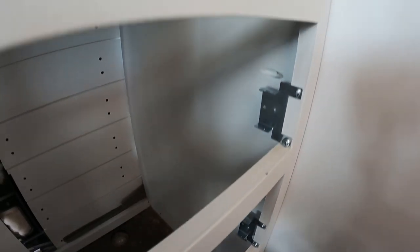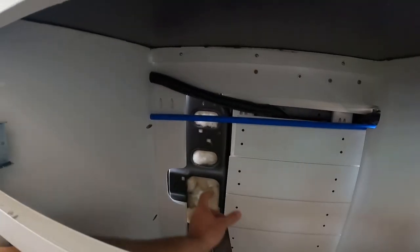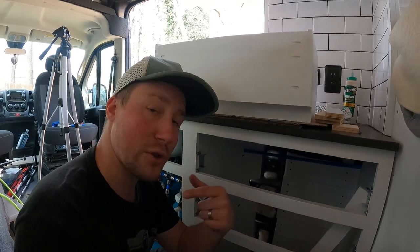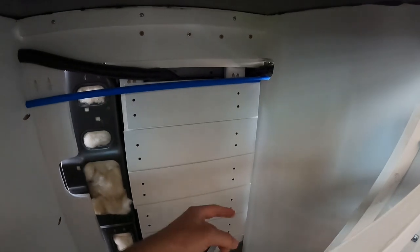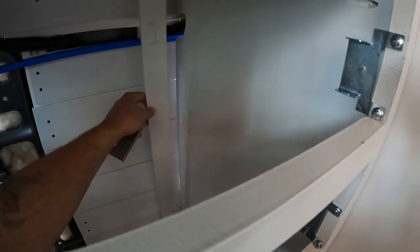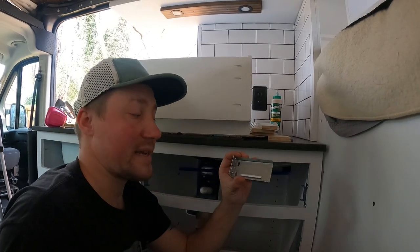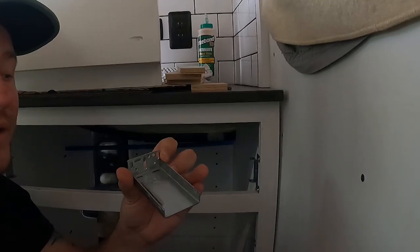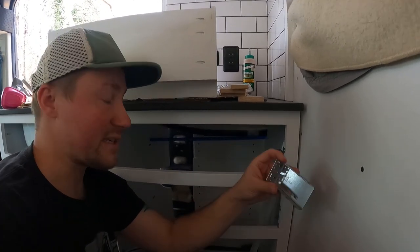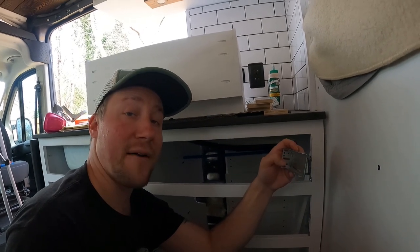We got all those brackets in. The bracket that goes on the back wall needs to be square as well. The best way to do that is to have a back wall of the cabinet. On the left side we have the upright that is the frame for the door on the outside of our water cabinet, but on the right side we just have the back wall which, as you can see from that gap, is not straight. So I cut a stringer, painted it white, and I'm going to pocket jig it there on the bottom and drill it directly into that piece on the back. The nice thing about these back brackets is you have two inches of play where the little tabs connect to the drawer slide, so this will be a half inch forward of the ones on the left side but that bracket can make up that half inch within the two inch distance.